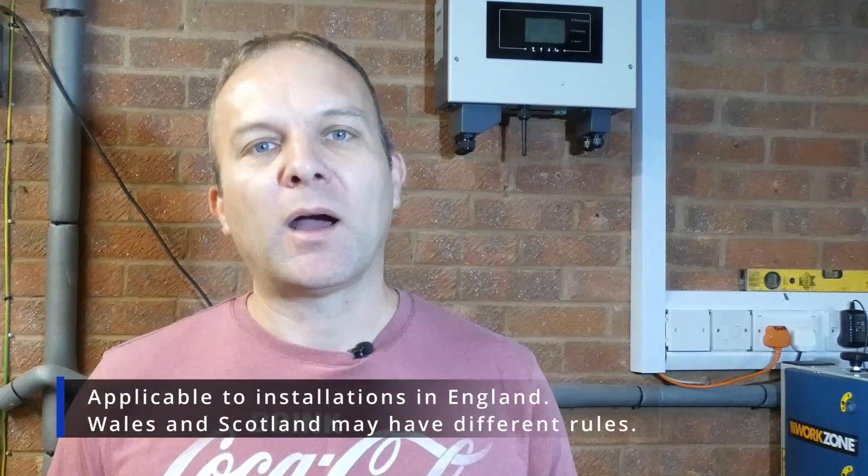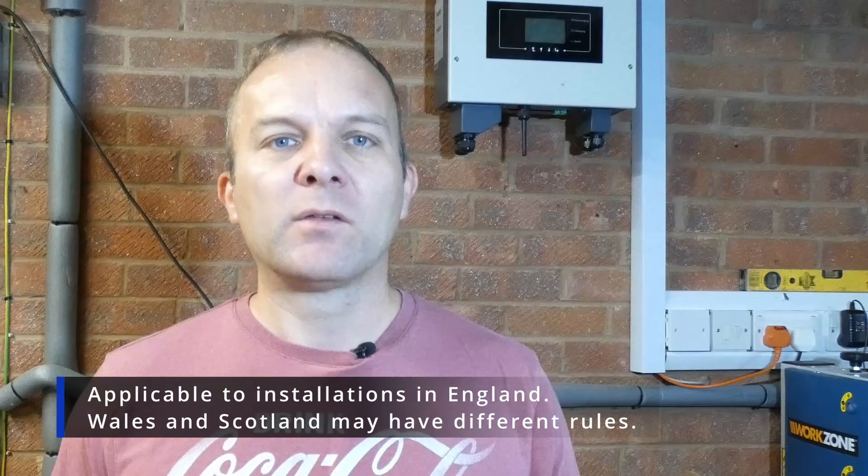This acknowledgement letter means that the installation can continue. However, that's not the end of the regulations. The electrical installation must comply with current standards and a commissioning certificate must be provided to the DNO. So that rules out a completely DIY installation if you want to stay legal. You must either use a registered electrician who has the required permissions, or use the local council building control to inspect and issue a certificate — though that's a very expensive route for electrical installations.